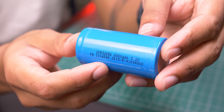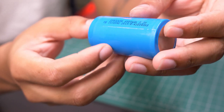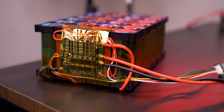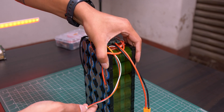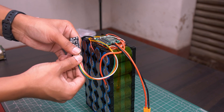These are really high-quality FBtech 32650 cells. These cells can easily get you 2000-2500 cycles at 80% depth of discharge, and these are rated for 3C. I have personally capacity tested these cells and the results are 100% what they are rated for. I got 6000mAh at 0.2C.